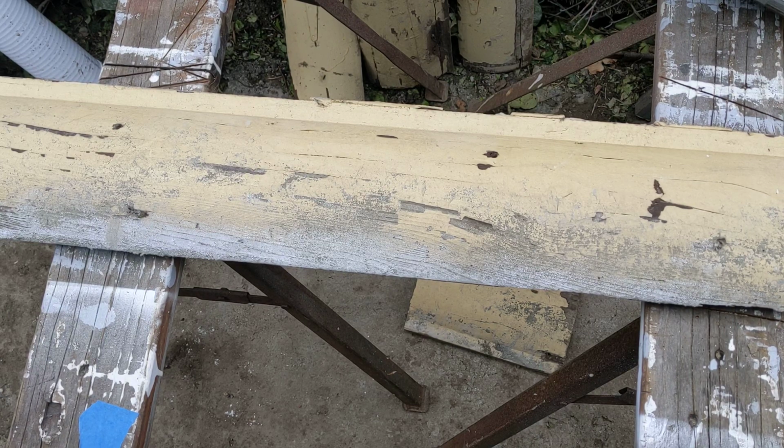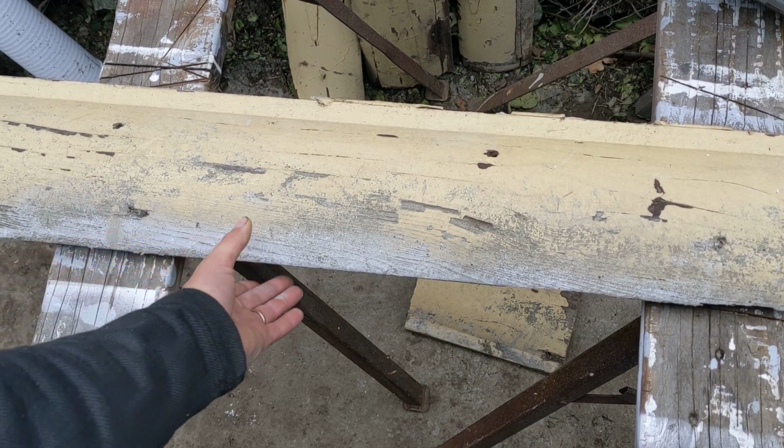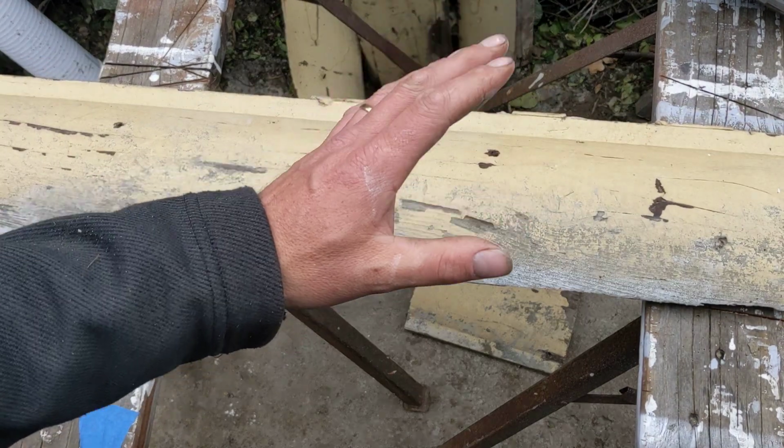And if you've been following along, you'll know that it turns into this horrifically unserviceable nightmare because you can't take the siding off because all the pipes go through it. So you never ever do that. You terminate siding and you transition. Your siding pieces need to be able to come off. So that's just a quick lecture.